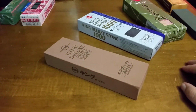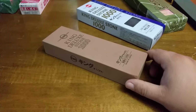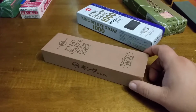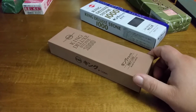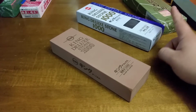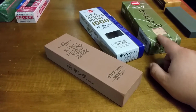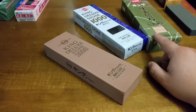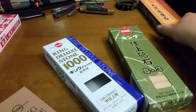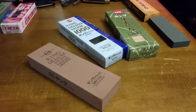To me, it's a little different with carbon steel blades. This is what I start with, unless I just got it and it's super dull. For my knives and swords, I don't let them get that dull after the first sharpening. So this is basically my starter stone when I sharpen anything, and then I'll move on to the 3000. This is a 6000. I have a 3000 coming in the mail, just waiting for it. I'll move on to the 3000 and the 6000, and then I also have this 12,000 grit natural stone over here for polishing. I already did a little review on that, and I'll put a link in the description.